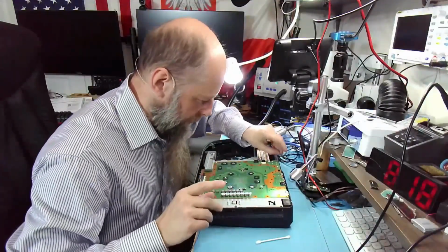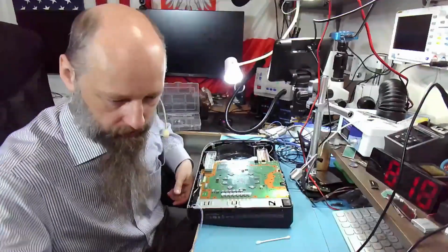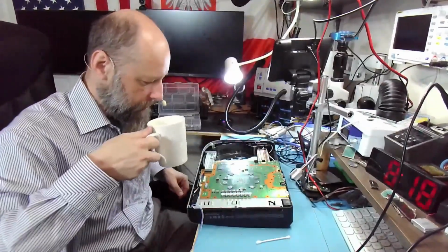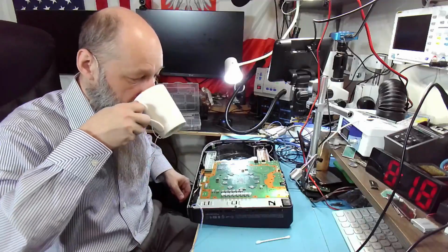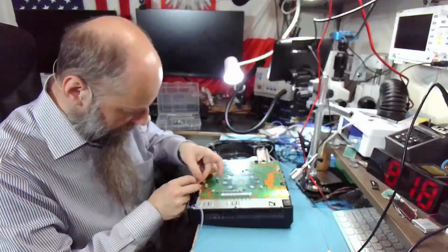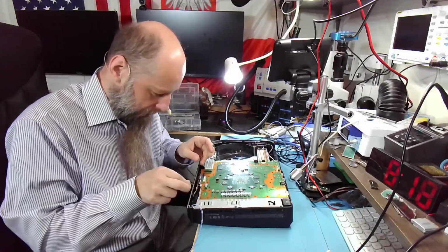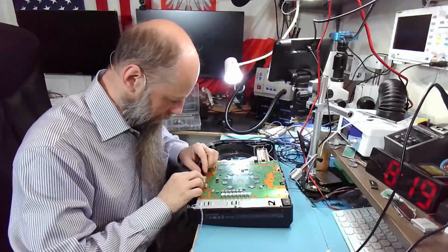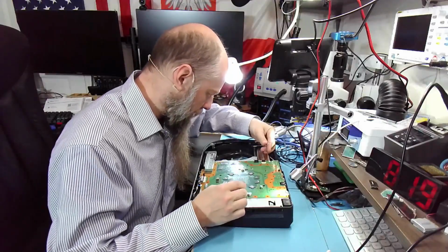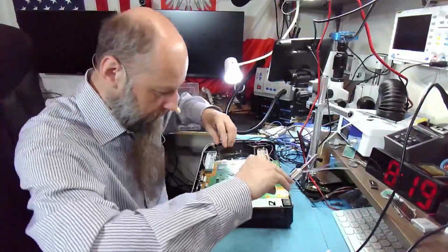One good thing about PS5s compared to PS4s is that they come with liquid metal, so I don't need to replace the paste. On PS4, no matter how new, as soon as you open it, you're gonna have to clean the old paste and replace it. Otherwise, it's gonna start overheating. It's gonna be worse than it was. And this is not going to be immediately noticeable, depending on the player, right? But the frame rate is going to drop a little bit because it's going to thermal throttle. Other than that, everything will be working. So you might not even notice, but that affects the experience if you don't replace the paste.